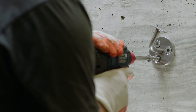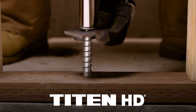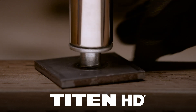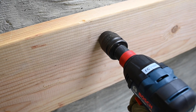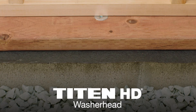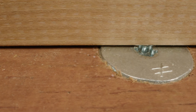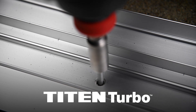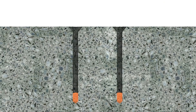Making it the most versatile collection of concrete and masonry solutions available. The Titan HD heavy-duty screw anchor features low installation torque and outstanding performance in cracked and uncracked concrete or masonry. The Titan HD washer head heavy-duty screw anchor offers a low profile for an unobtrusive installation.